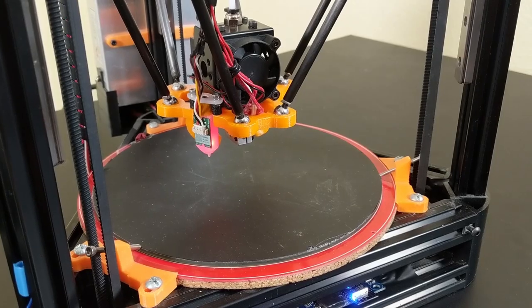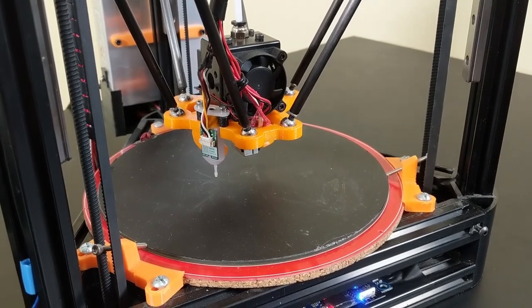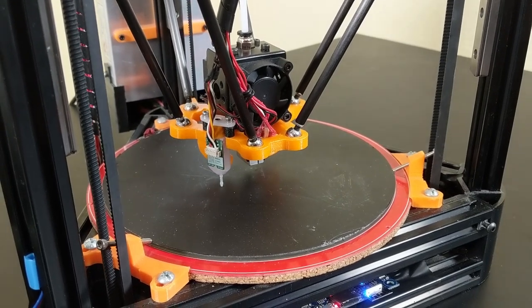And that means that without doing any updating or changing the firmware at all, I'm actually getting some functionality out of it just the way it is. It thinks it's in the Little Monster still. So let me show you what I'm talking about. We can home the printer. We can drop it down to a lower, closer to the bed level. Oh, I homed it again accidentally. There we go. See, I can move the end effector around. And most importantly, I can run a G30 command, which is probe in place. And that will test the functionality of the BL touch sensor. And as you can see, it's working perfectly.